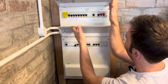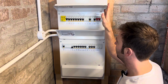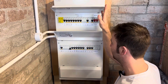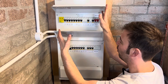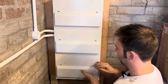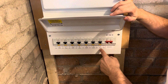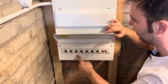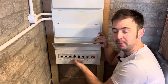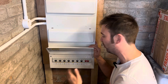There are seven spare ways for the client to make any additions or alterations. I could have done a double stacker and a single one for the off-peak, but I thought a triple stacker made more sense. On the bottom row we've got the off-peak supply with all the heaters — there are seven storage heaters throughout the four-bed property. There's a blank between each one for thermal derating — look that up if you're not familiar with it.